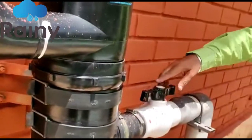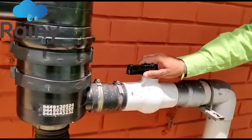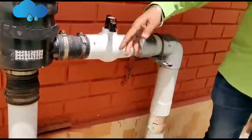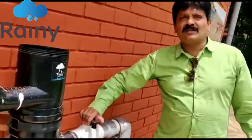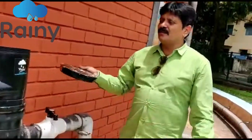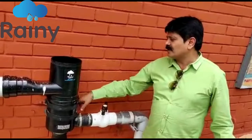The ball valve is provided at the clean water outlet. If you want to allow the first flush of water to go out, you can just close this valve so all the water goes out through the drain outlet. If you also want to clean your terrace, you can close it so all the water diverts out. This makes it very user-friendly.